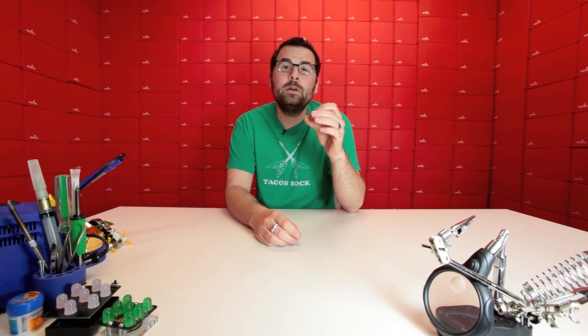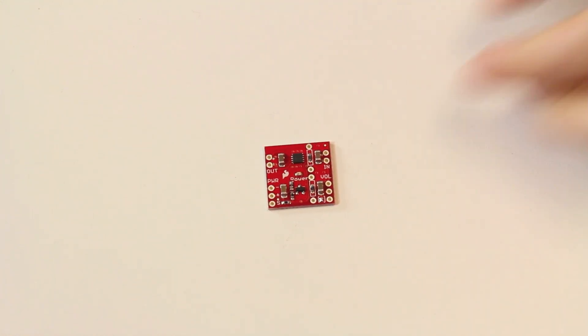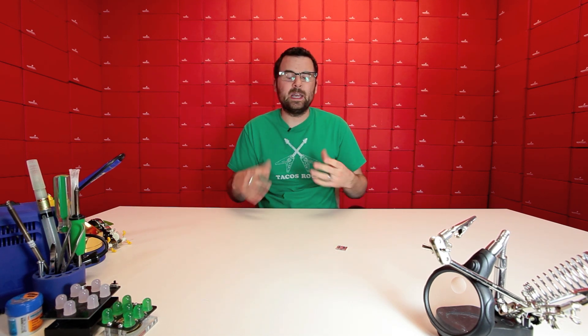Lastly we have this little guy — this is a mono audio amplifier. If you look at it, it is very small, about the size of a quarter. It's a very small and very efficient audio amplifier. It produces about 1.5 watts into an 8 ohm speaker. You might think 1.5 watts isn't that much, but alarm clocks and some TVs really only have about a watt or two of audio power, so these can actually produce a decent amount of sound. A lot of our sound boards like a musical instrument shield or the MP3 trigger have a headphone out.